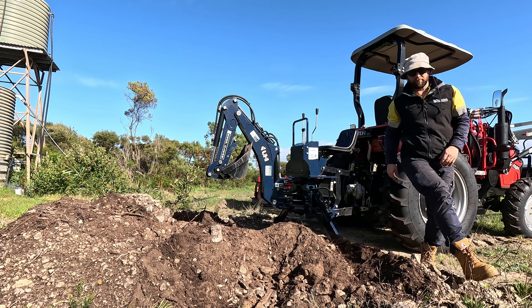One other thing — don't lift up too high off the ground. It can potentially go up to about here, but it'll bend the drive shaft, which would not be good. Alright, I'll put this back together and we'll fire it up.